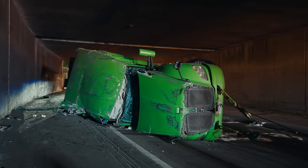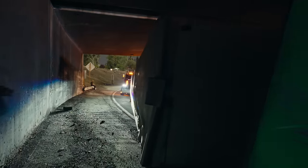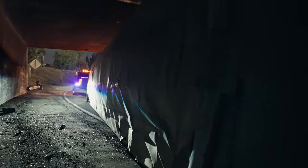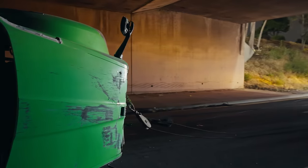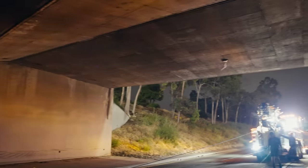So what these boys got is a fully loaded tractor with the dry van trailer. And that's the driver sitting all the way at the end of the bridge. Not only is it a loaded dry van trailer that buckled, as you can see right here, but it's under a tiny 9-foot bridge. Impossible to put the booms out here and get on this side. So what Alex and Dave are gonna do, looks like they're already setting up, pretty much done, is they're gonna attach the winch lines to the front of the tractor and drag it out as much as they can so we can have a good working area with the booms right here.